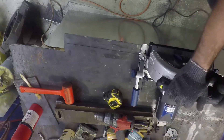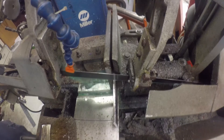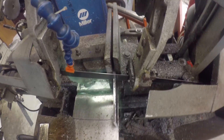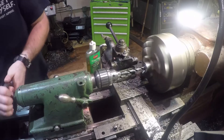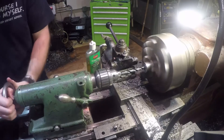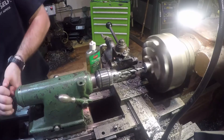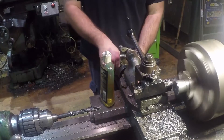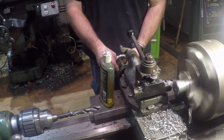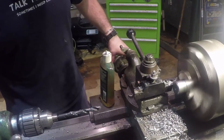I start out by cutting some stock plate out of a sheet of quarter-inch steel plate. I then cut out the sides of the spacer from the stock with the use of a bandsaw. Now I make a mock-up spacer — this will be used to set proper spacing. I used my lathe to drill a hole in some rod that I had laying around. And now for the part where I goofed: I faced the ends to not only square up the mock-up spacer but to cut it to length. I must have mismeasured somewhere.